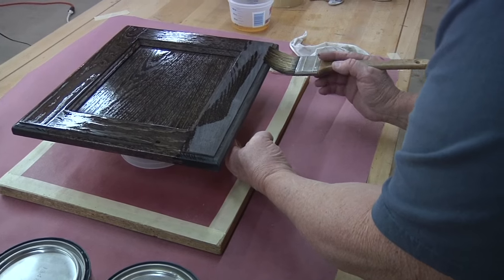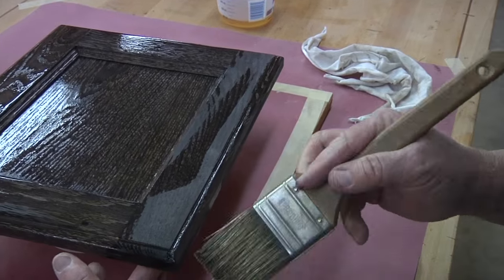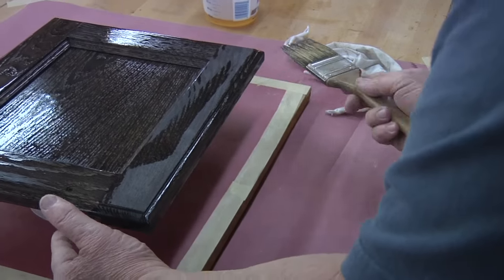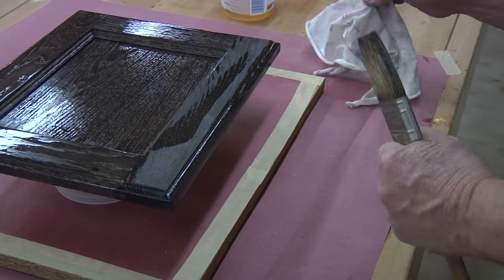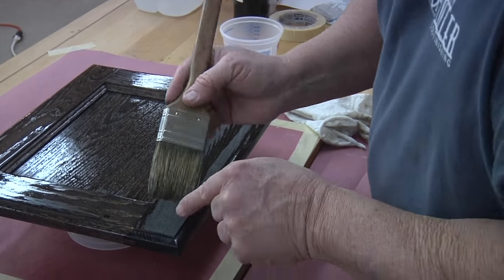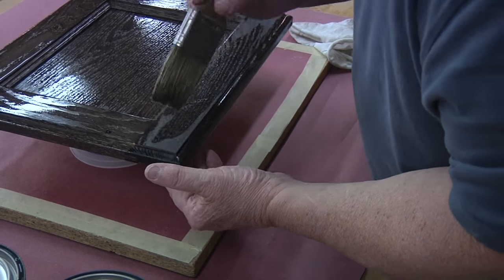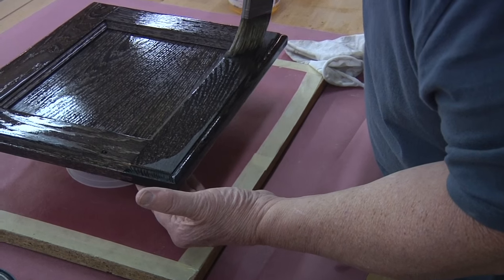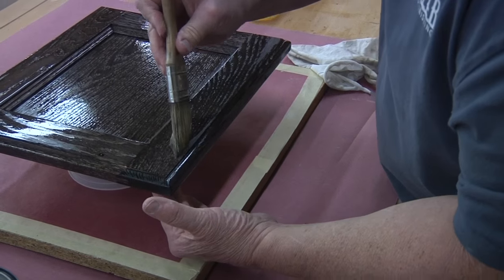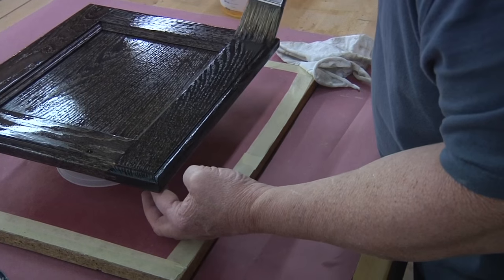You can take the brush and actually squeeze some of that finish off the bristles onto the edge I want to apply it to. Lay it off, leave it alone. You're done. Wipe that edge again. I don't want to start right here because I don't want the finish rolling down onto that edge that already has finish. So I'll start it away while it's loaded with material. Okay, I have 100% coverage. Now I'm just going to lay it off, tip it off.